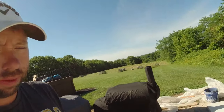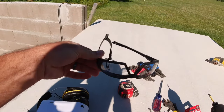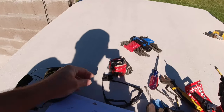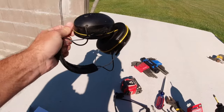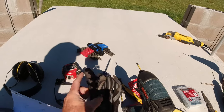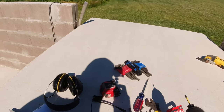If you're going to be using that saw to cut your steel, a couple things to be aware of. One, it produces a tremendous amount of sparks, so make sure you have sealed eyewear. There's also a tremendous amount of noise, so get some ear protection on there as well. And save your fingers - there's a lot of sharp edges, so get a good pair of gloves as well.